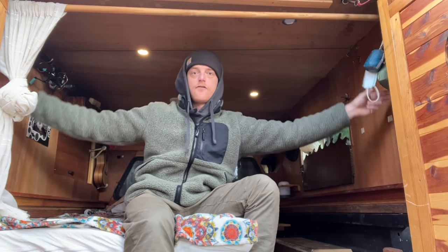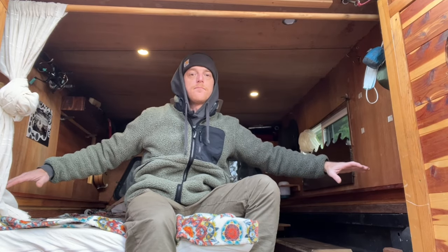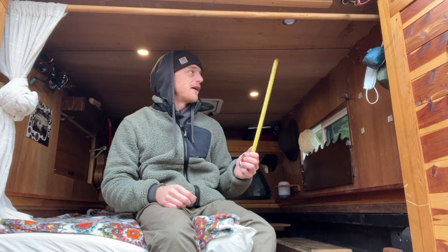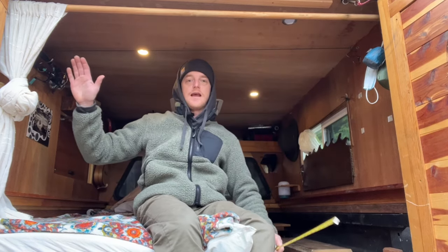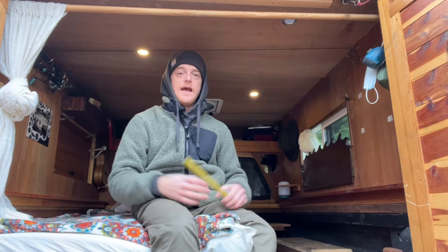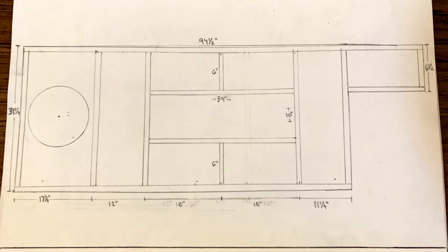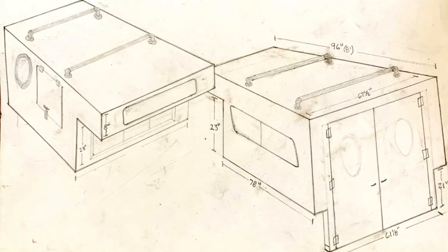That creates an L of two-by-four in the back and on the bottom of the frame. So for me, designing and building the frame came down to building both side walls freestanding in the shop, then connecting them with cross supports to create a full unit. The key is to think it through before you start putting wood together — draw it out, sketch it a bunch of times, get your measurements right, and really think it through, because that's going to be the foundation of your entire build.